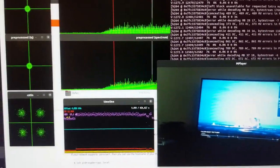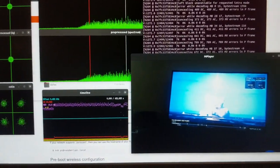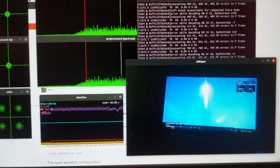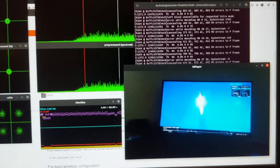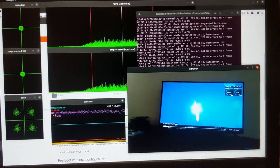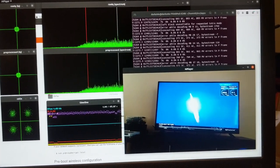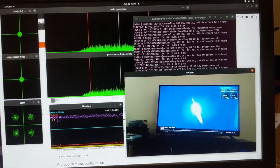So with 44dB of attenuation, that's approximately negative 90dBm of signal power at the input to the RTL-SDR. With some additional preamplification, we can probably drop that MDS a little bit further to improve the system noise figure. But it gives us a good starting point to figure out what kind of antennas we need and what our receive setup must look like to be able to receive signals from this payload.